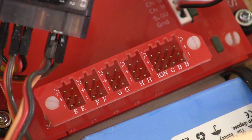The E, F, G, and H ports are for the servos, and you notice that there's two connections for each one. SmartFly does this to be as flexible as possible, particularly with programmable servos. For instance, you can put both elevator halves into one port and use one channel on the radio. Then with your programming, you can match these servos so they work properly for your setup, and you only use one channel.